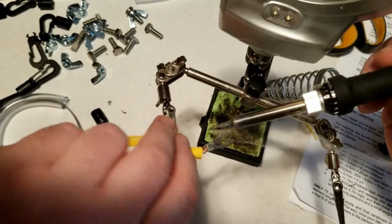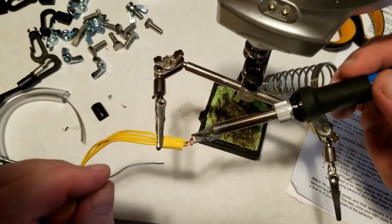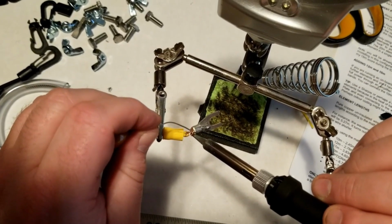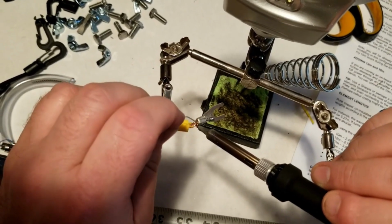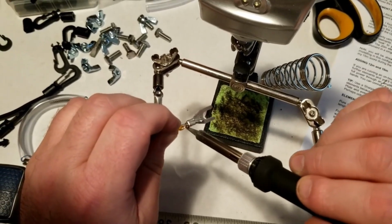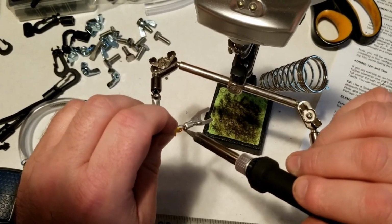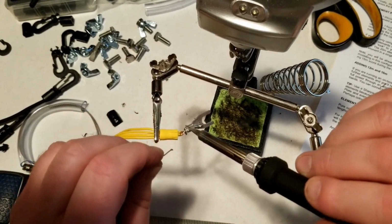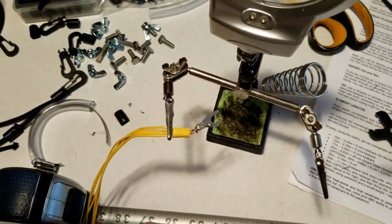So again, easy to do. You can use the wire that Callum provides. Again, I chose to buy some cheap wire to do this, just to make sure I would have plenty of extra wire for elements. I'm using 5 elements currently, and I still have room for a 6th element, so I may decide to put something else on. But I do have plenty of that D10 wire left to go. The D10 is, as we'll see with the elements a little bit later, copper and steel, so it's a decent wire.